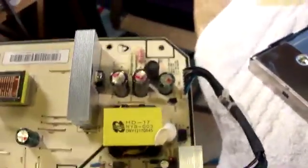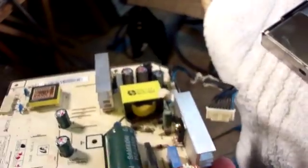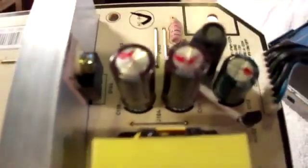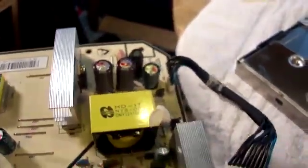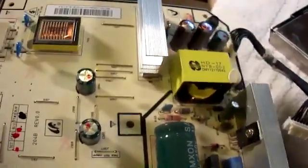I've got the back side off. You hunt down on the back where these two capacitors are. Other people are replacing additional capacitors as well. I've ordered enough capacitors to do two of these screens. At the moment I'm only dealing with these two really offensive ones that seem to be the only problem. Check the top of your capacitors — if they're bulged, they're bad. It's not really that hard to take these apart once you've figured out how, so I'm just going to replace what I know is bad.